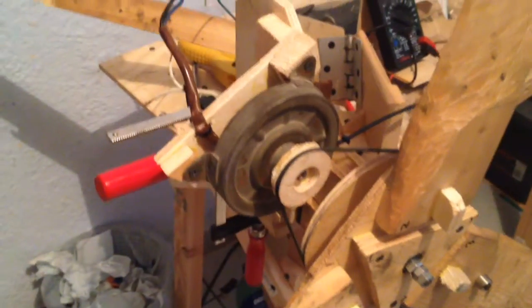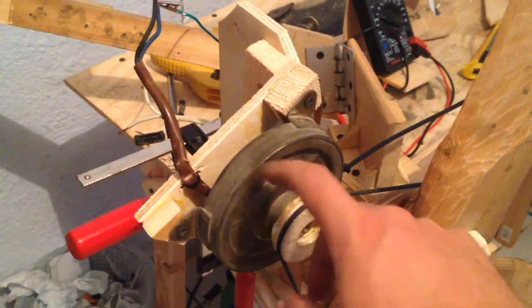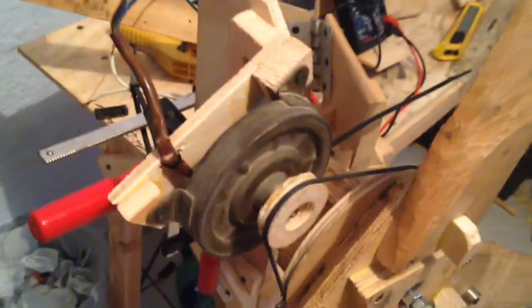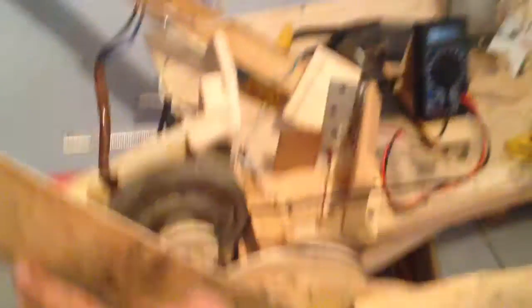I got this car fan motor for free. What's great about it is it's a very flat motor, which means the motor windings move a lot inside, so you get a high voltage at low speed. If I can just spin this by hand — this is a 3 to 1 ratio, with a 6 inch pulley on the blades and a 2 inch pulley on the motor — I can get up to 1 volt pretty easily at a very low speed.